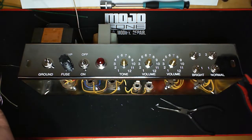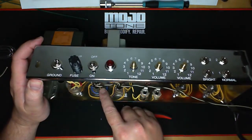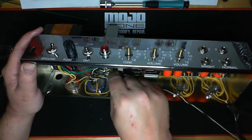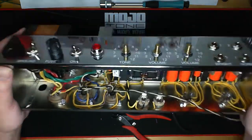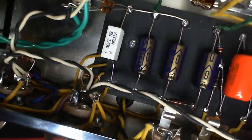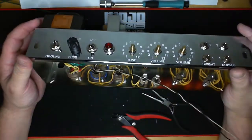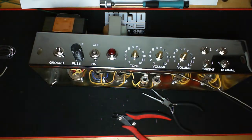We're back. I have the filament run from the pilot light to the first 6V6, then bussed over in parallel to the second 6V6, and leads already attached on the pins ready to go to the preamp sockets. I like to run these up and over in this instance. I also added the 1.5k resistors back here — they'll stand up in the chassis like the originals did. Fender placed them off-board to eliminate a lot of lead length. I'm going to run these down to the preamp tubes and be right back.